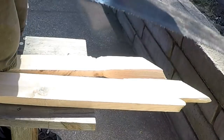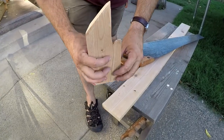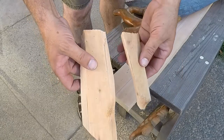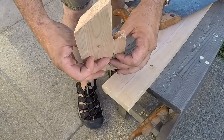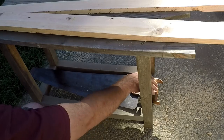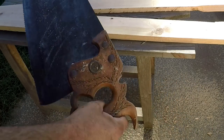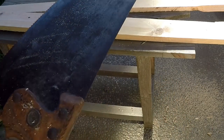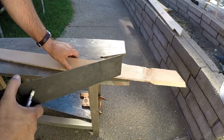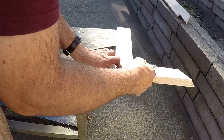It split on me — probably that knot, but no big deal, it's all waste anyway. I figured out why it broke while I was ripping: there's a crack at the end of this board and it just popped out. There's a nice little spot underneath here where you can rest other blades. This crosscut saw is probably too fine for ripping, but we'll use it to get rid of all this junk with the knots.